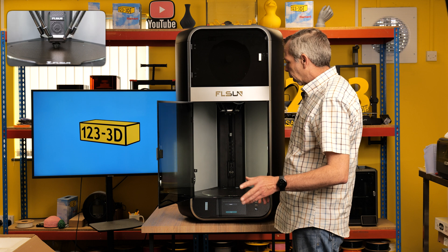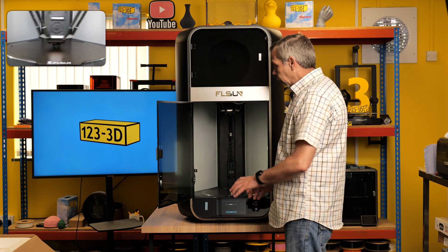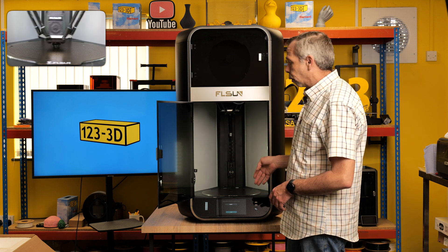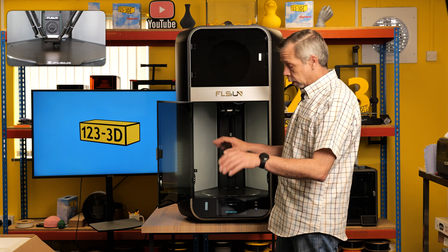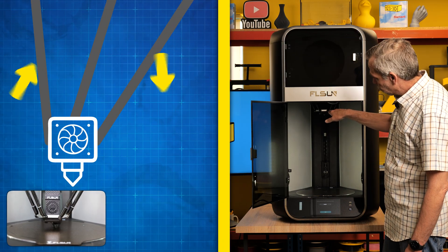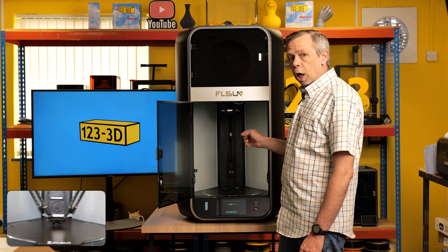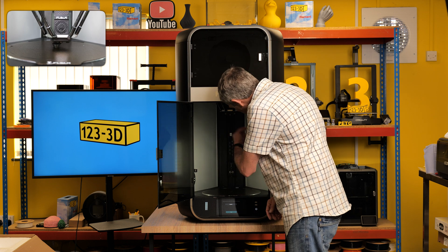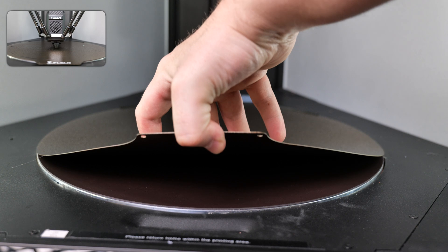Inside the chamber, there is quite a lot going on. This is a delta printer — you've got three axes that move, that is it. Whereas a traditional machine has the bed moving and the extruder moving left to right, here you've got three belts that move the extruder up, down and in all directions. That's why these machines are ridiculously quick. Other features: nice lighting on both sides, a direct drive extruder, and a PEI flexible magnetic build plate.